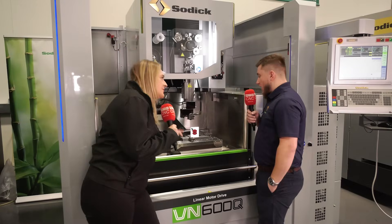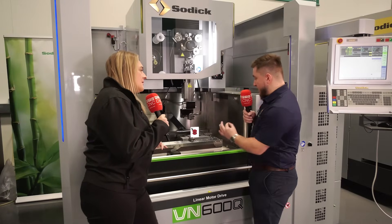And then it's the button — the core, the seed in the middle. We've done that as a punch and then the die afterwards. But it's not actually three cuts, it's six cuts — we're actually cutting rounds. We've done six profiles and each profile has got a four-cut surface finish, so we're talking 0.3 RA surface finish and two to three micron accuracy.